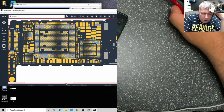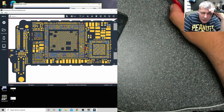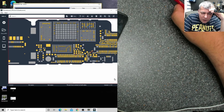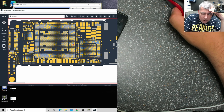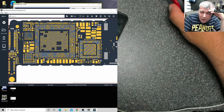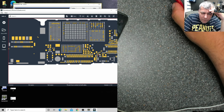This pin of this transistor is going to many points. You can see the red points, so that means it's not my signal way. The signal way is the other pin, and it's coming here. Probably here it's a capacitor to ground. The gray is ground, so we don't care. Here probably we have a resistor from here to here. And from here, let's see where it's going. Straight to the processor, you can see? So clearly this is a clock or data line, yeah?